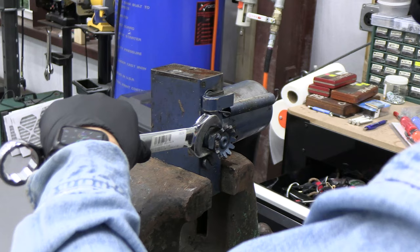Okay, a few extra things. I oiled the front wheels through the little oil slot, the rear wheels, the bearings. I put a little oil on the edge for this cup to rotate on, and I greased this cylinder. And this jack is ready to go. Take a look at how well it works. And then we want to lower it. It's great. And I checked the oil again. It was absolutely full before I put the plug in.